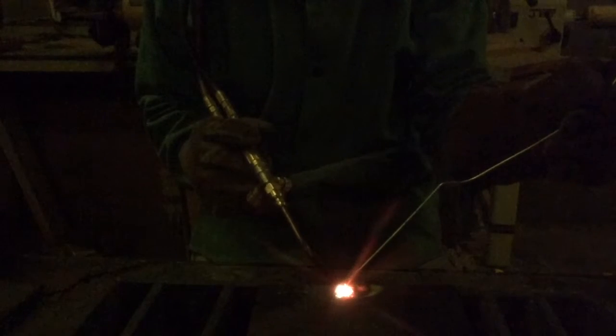I got a hole — not a big deal. If I get a hole, I need to cool off my metal. If I have a hole, that probably meant that I put too much heat in that one area without putting filler rod in there. So I'm going to come back a little bit and heat up behind it and get a puddle back.